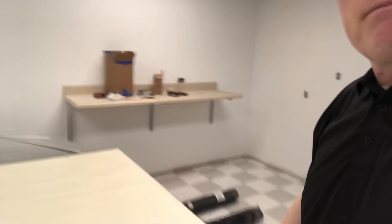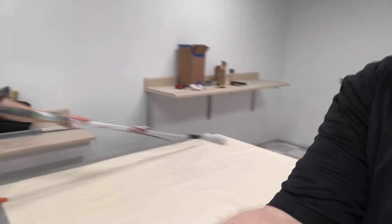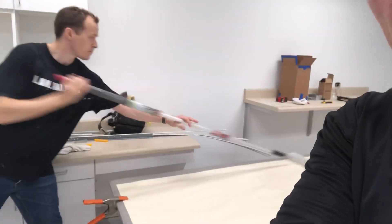We have a small job today — we've got to put wallpaper on these walls. So how do you put the glue on your wallpaper? Well, if you don't have a pasting machine, you can simply do it the old-fashioned way: roll the paper with the glue or use a pasting brush. Wallpaper hangers, particularly those in the UK, use brushes about 10 inches wide, but they tend to take a big toll on the wrist. So what we do is we use a roller.